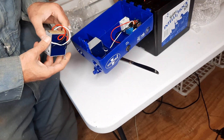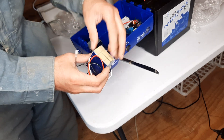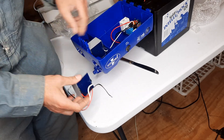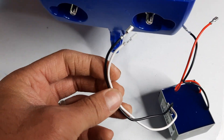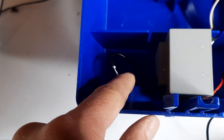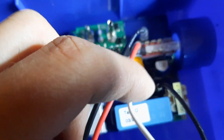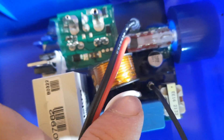This piece is going to stick to the bottom with some sticky tape or glue of some kind, and the transformer is going to sit this way. Looks like we've got a red and black wire, and then a black and white wire. Looking in here, the side with red and black is going to go to red and black, and the side with black and white runs through here and plugs in there.